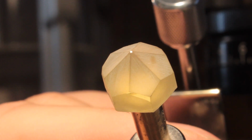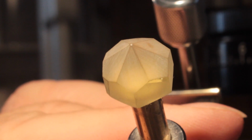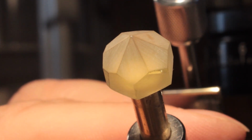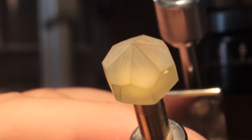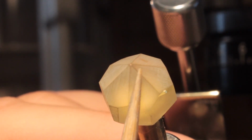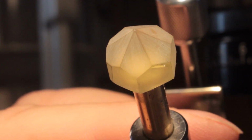Okay, I've gone through the first girdle set of instructions. The stone is a millimeter bigger than I want it, so I'll trim it down another millimeter with my finer laps. And of course, I showed you earlier, I didn't come down quite far enough to make the center point. There's a little further to come down, but I'll do that with my next lap.